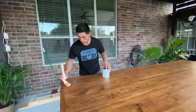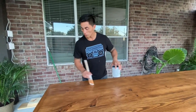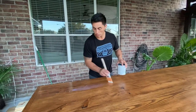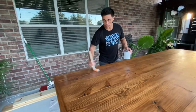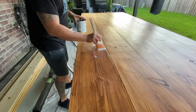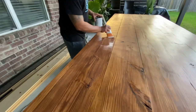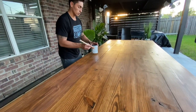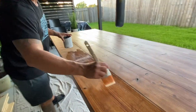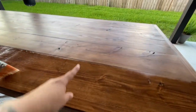So I think you're supposed to use three coats? Yeah. That's what the lady I follow who works with Home Depot says. So for the first two coats, you basically just brush them in. And for the third coat, you sand it down and then give it the third coat. So it looks kind of purple-blue, but it's going to dry clear. Yes. So don't let the color freak you out. And this one is specifically for outdoors. This will dry like this.